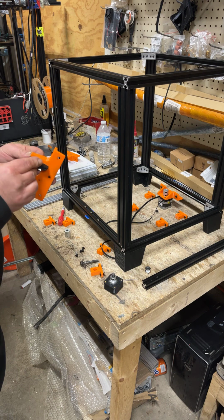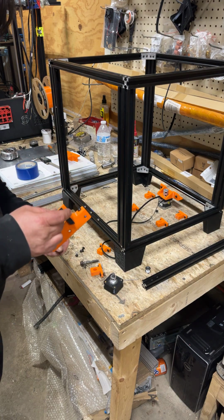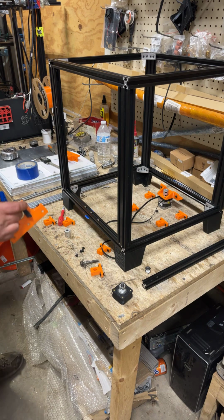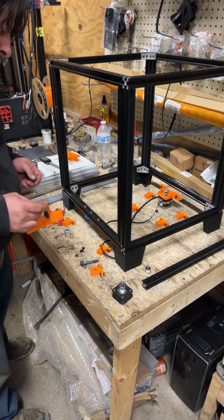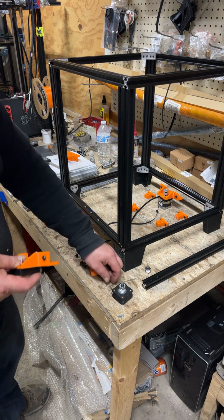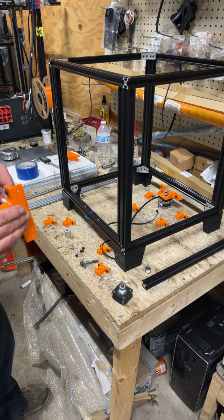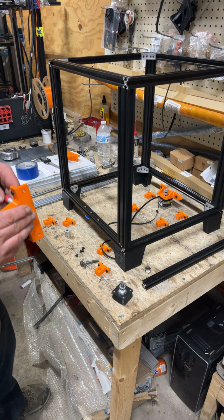Basically, I'm building these, and then I'm gonna flip the machine and center up my steppers. And also, there is an advantage with using aftermarket Ender 5 lead screws. They have a different amount of starts on the threads, and that's why on an Ender 5 the Z steps are doubled to 800 instead of 400 for base starting settings.